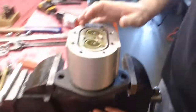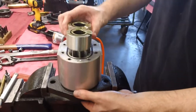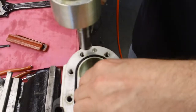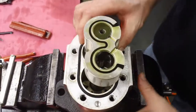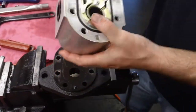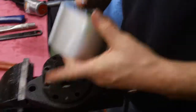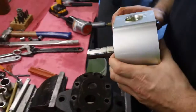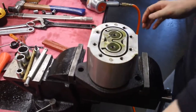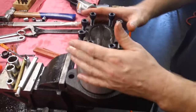There's the end cap. Now he's going to push the shaft up. He's swapped the bushing from the drive gear to the belly gear, keeping everything together and making sure both seals are in place. Then slipping it back through, turning the body 180 degrees, shaft back through — seals are still in alignment. Now he's going to install the end plate.